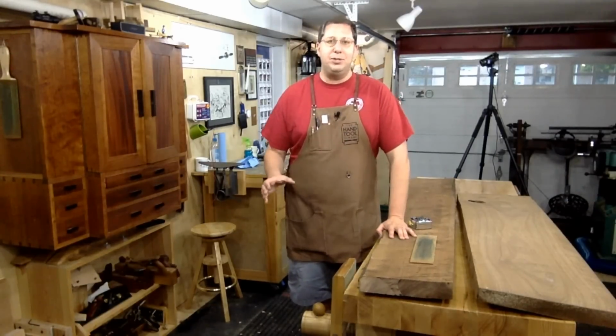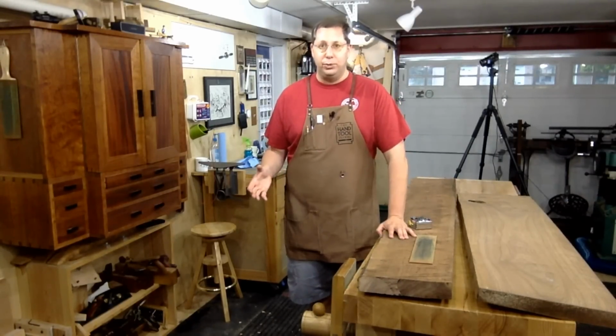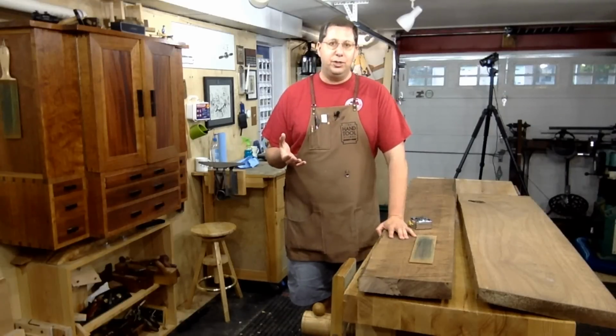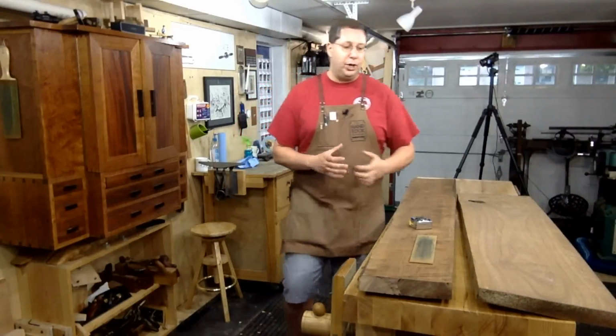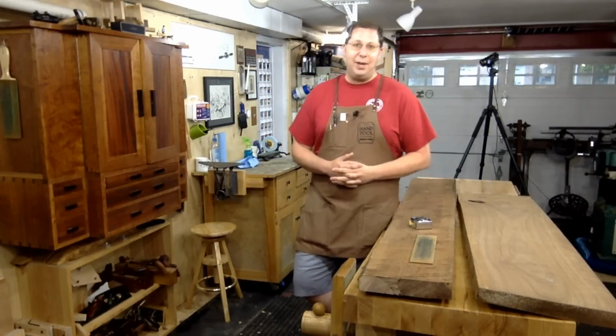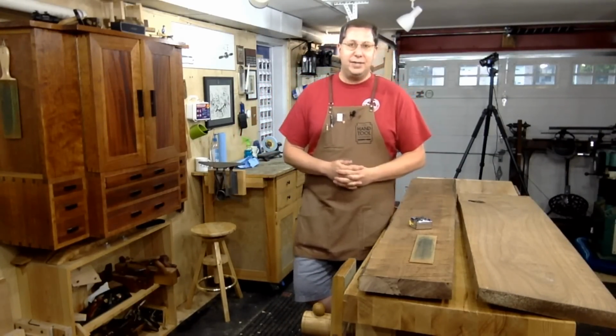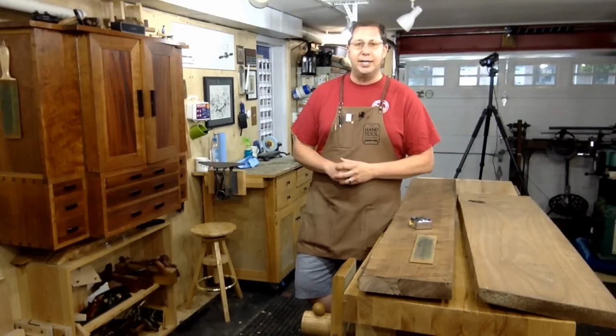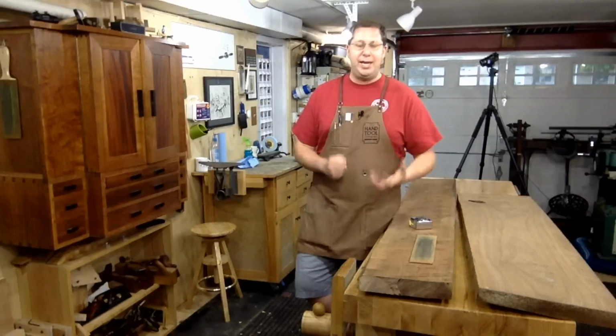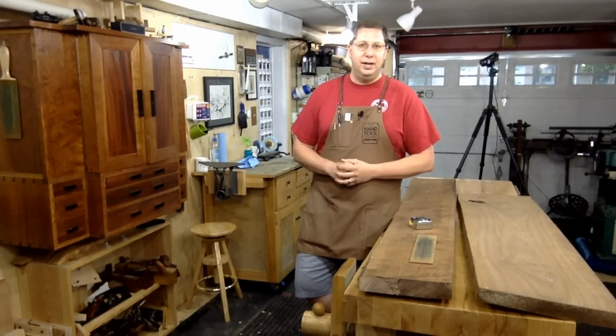If I wanted to do any demonstrations for the general public, I had to sharpen my tools. It's also where I got a lot of experience on oil stones. So I just started doing it, and frankly, if you were to go freehand, it's actually the way I recommend. Just go cold turkey, because it really wasn't nearly as hard as I'd made it out to be in my mind. And I stopped paying attention to angles and things and just focused on getting a burr.